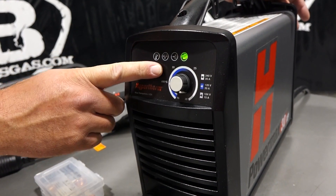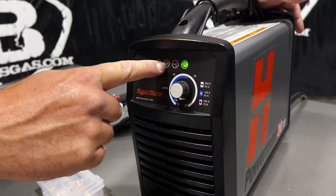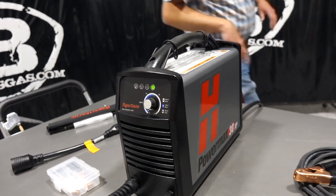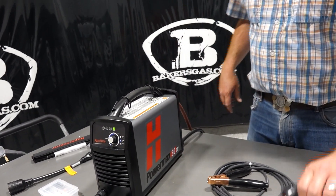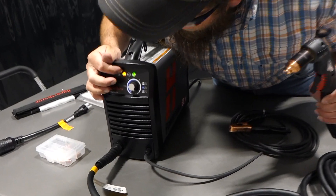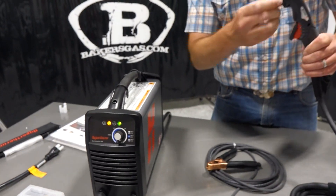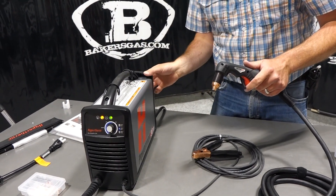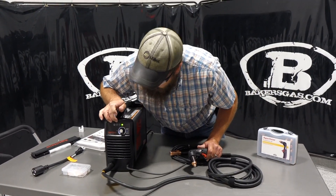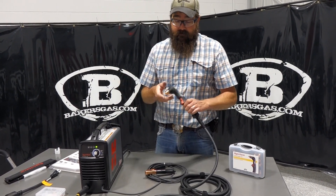When it's on, it shows we've got power. This is our air pressure line indicator — we're good there. It'll light up orange if there's an error, and this one will also light up orange if we don't have consumables attached. That last light is temperature — if you duty cycle the unit out, the temperature light pops on and it shuts off. If I unplug the consumable, we get an orange light. Plugging it back in, the orange light stays and it won't cut. The fix is to cycle power to clear the error code — that's all you need to do when changing consumables.